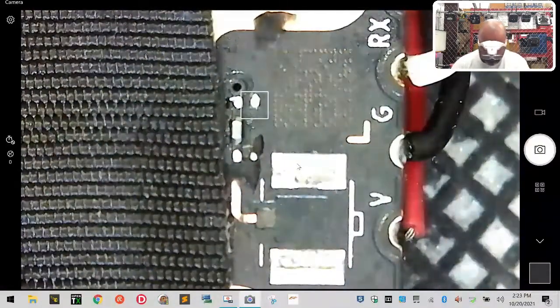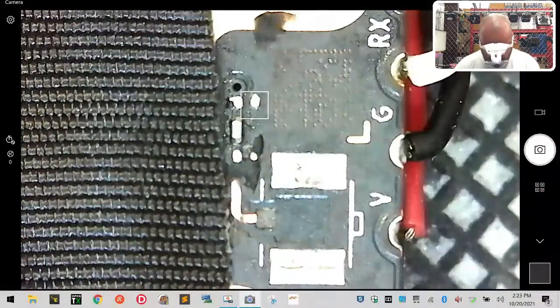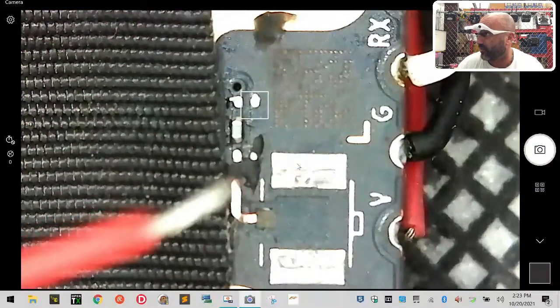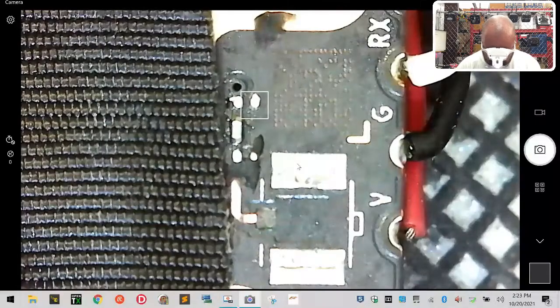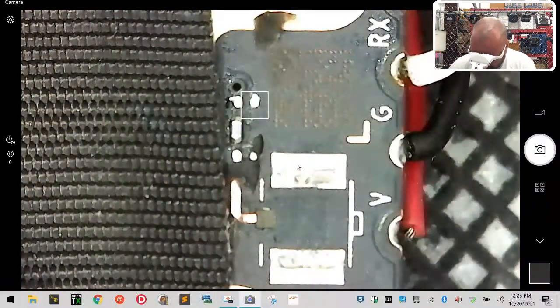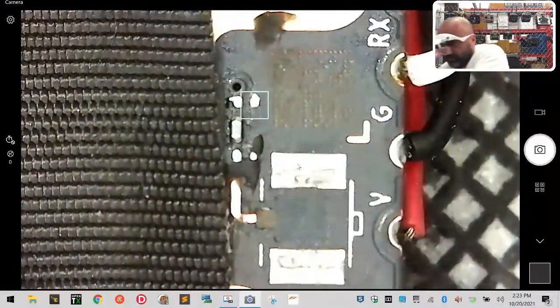Okay, so here's the wire that I'm going to use. I'll pat down the microscope here for you to see. That's the wire right there, and it's actually massive. This is a very small wire, but it's massive right there. I'm going to spin those strands up super tight, and then I'm going to solder it. Okay, I'm going to tin it, is what I mean to say. Let me go ahead and do that real quickly, and then I'll show you guys where we're going from there.